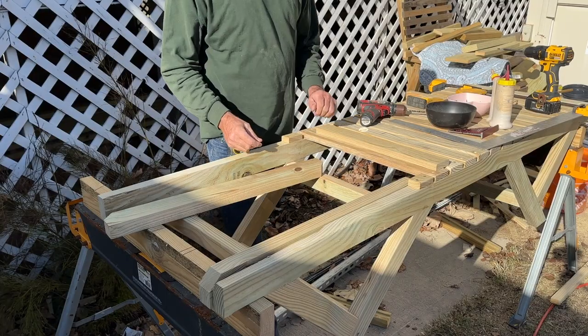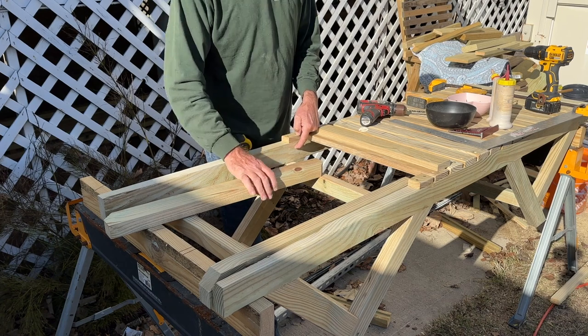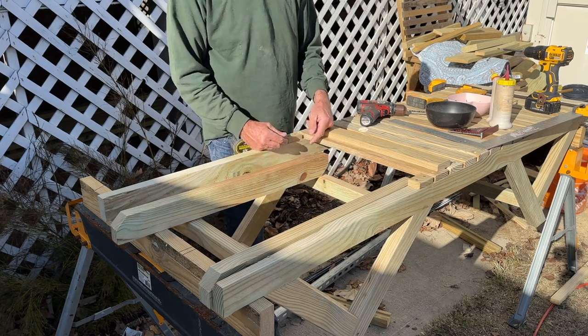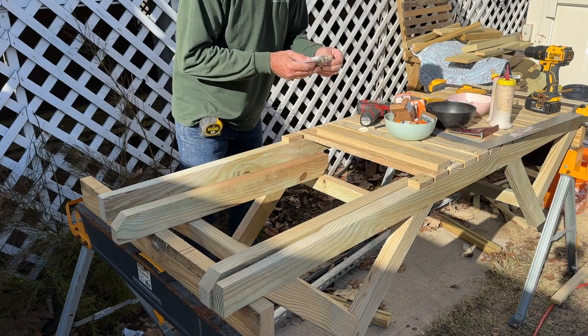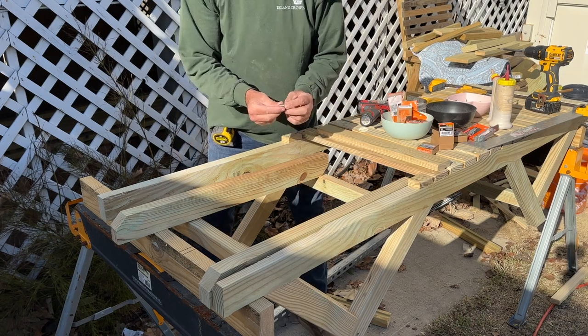And there's going to be a nut insert going into here with a 5/16 drill. And then there's going to be a quarter inch screw that goes through here. It's a machine head screw, not a wood screw. I think this is called a nut insert, threaded insert. Now I'll have a link for these also. There's the threaded nut insert.